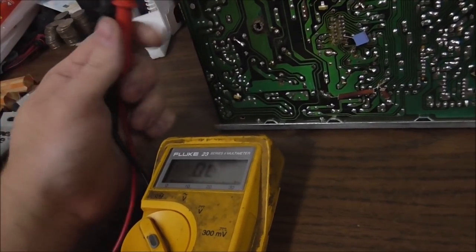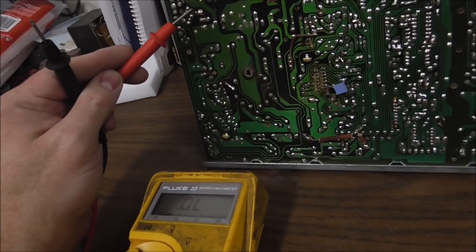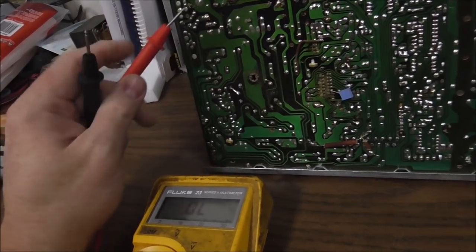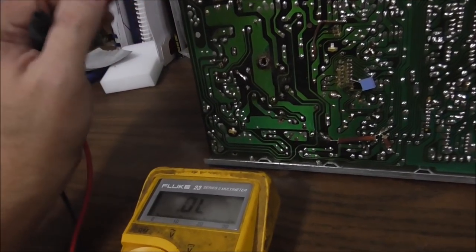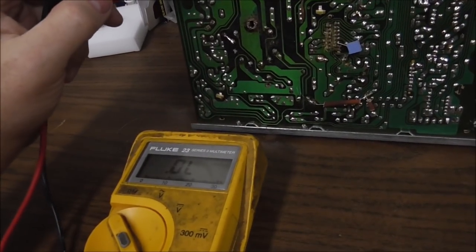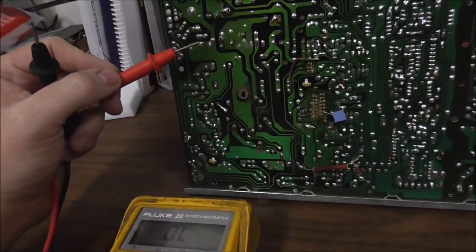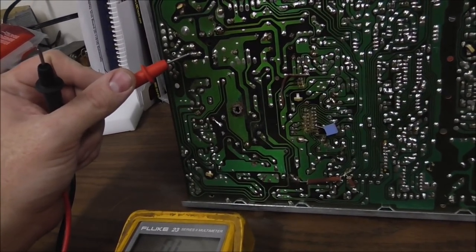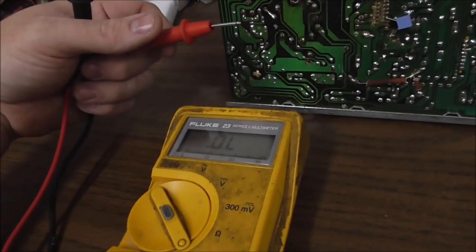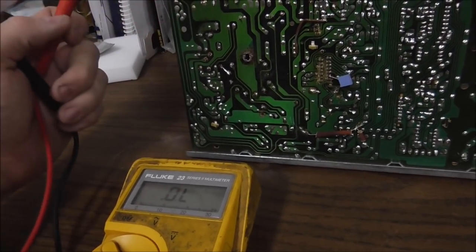If you take this out, just going by experience, and obviously I never went to school for this, you will find that those two pins are not shorted. But they test shorted in circuit because of other things on the board. Again, we're just talking about things specific to a Hantarex Polo. I've done that before and know that you can't test it in circuit because you get that short. But you can test from the center to the outside legs like we just did. And you saw we got 0.4. We didn't get a short. So our HOT is actually not shorted.